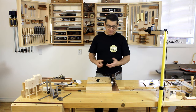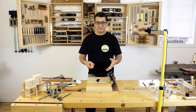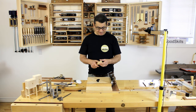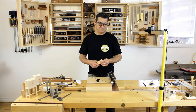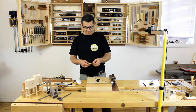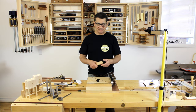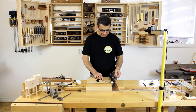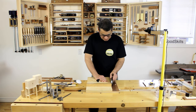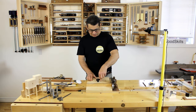This is a very effective way of trimming to a predetermined size. If you think about it, there's almost no other way to do this precisely. On a band saw with a thin blade, it creates a small curve and a rough edge. On a table saw, you're more than likely going to undershoot or overshoot the cut, leaving waste or cutting the board too short. That's why I use shooting boards for almost all my trimming.